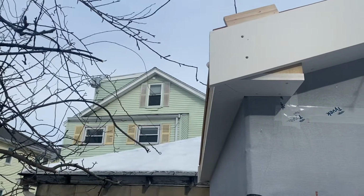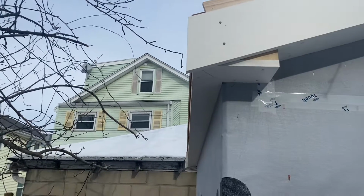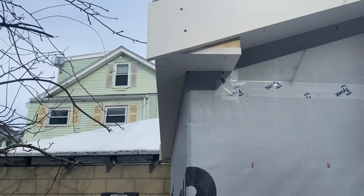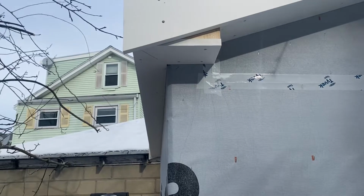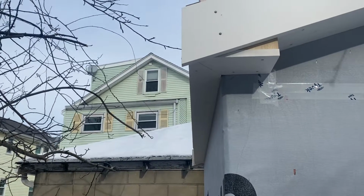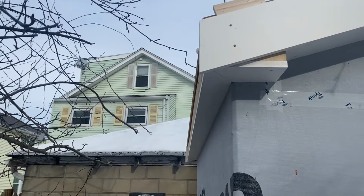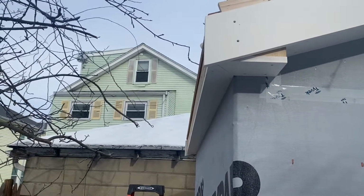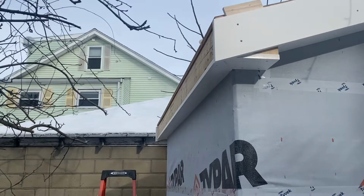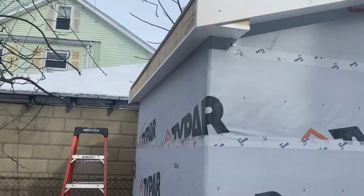These ends here, obviously there's 4 of them, 1 on each corner of the building. These are actually going to be trimmed. I just want to get the bird box pieces in place because they kind of set the reveal correctly, and then the bottom corners will just be trimmed off. I'll do that either with a hand saw or very quickly with the reciprocating multi-tool, and that's not going to be a problem. I should be able to get a nice clean cut.